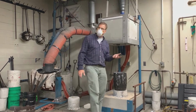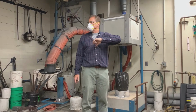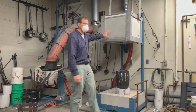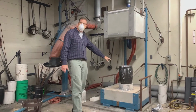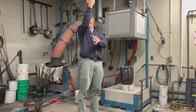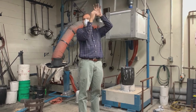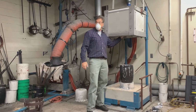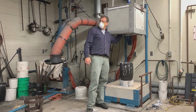We will go through some of the other types of furnaces. We do a little bit more of that in the second casting class when we start using the tilt core furnace. This is called a lift coil furnace because we're lifting the coil off of the furnace and the crucible stays there. We have some where they push the crucible up and out. The problem is you're now exposing the cylinder to the radiant heat. Actually, this does not get that hot. It just gets hot because the metal gets hot, and the crucible gets hot, and then it gets this hot.